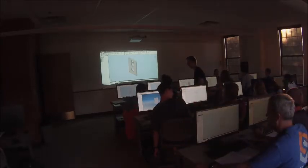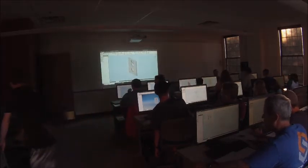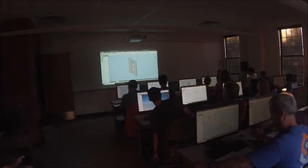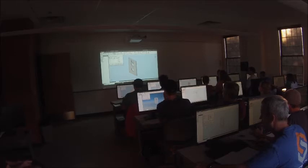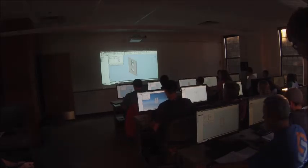Okay. All right. Next, we're going to round the corners, right? You never want sharp corners. Okay? And in a gearbox like this, you typically want pretty significant radiuses. So we're going to click on fillet. By default, it gives you an eighth of an inch fillet, which is pretty good. So just click on the edges of the corners. Make sure you're not clicking on this front edge. Don't click here, click here.